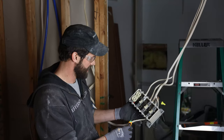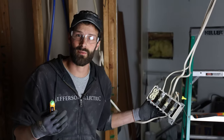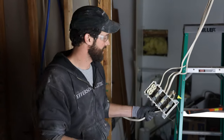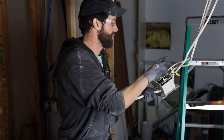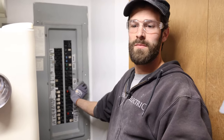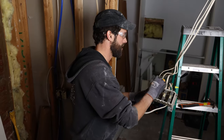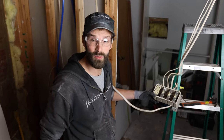We're just going to keep testing. Right there — that is live. We've got another circuit coming to the bathroom: first one's off, second one's live. The circuit right here, this power, that's enough to stop your heart. So we're going to do this the proper way — we're going to identify the breaker and go shut it off. Here's the breaker panel. Master bath. Double check, double check. Boom, everything dead. We could have more than one circuit in this box — we don't know. Be thorough.